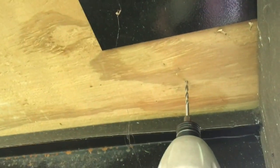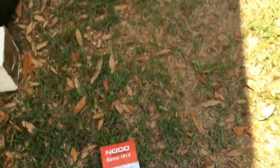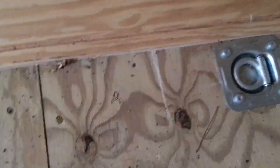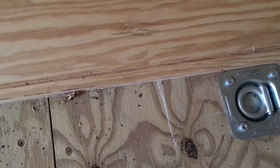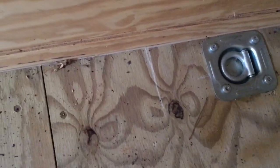Looking underneath here, I'm going to run a pilot hole in. These are the two bolts on the inside, so I'm basically going to line up the outside of the two-inch hole with where I'm going to drill. Should be about right there. Maybe a little closer — let me get it closer to that wall just a little bit. The beauty of a pilot hole is you run it through and you see where you pop out. That looks pretty good. I might want to get a little closer to the edge than that, so I'm going to slide it in just a little bit.